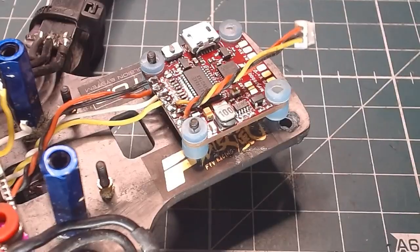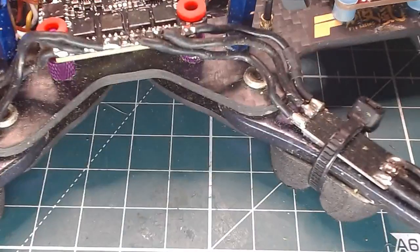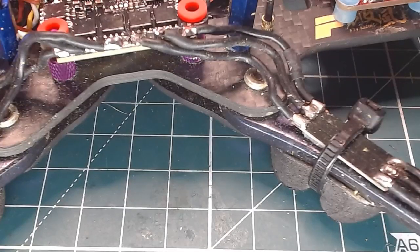And let's check it with a 5X loop. Make sure nothing's bridged, and we're good. Although, that ground wire is a little bit ugly. The last one I did is not sitting quite flat enough on the pad for my impossible standards, so let's just push that guy down, and we'll be all set. There we go, that's better.